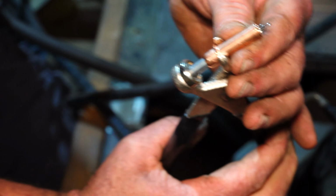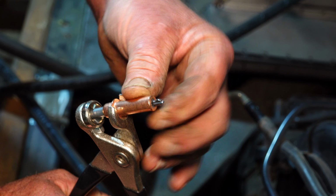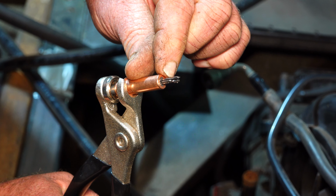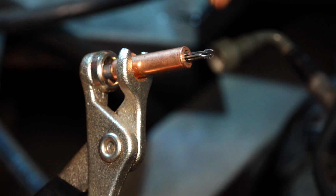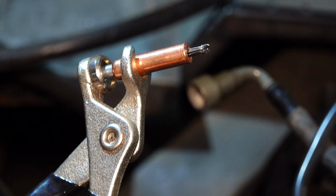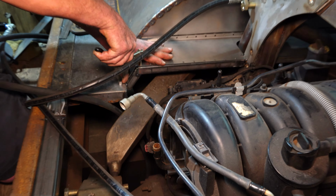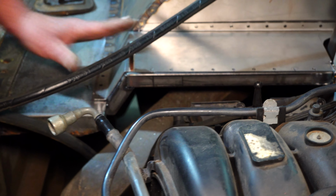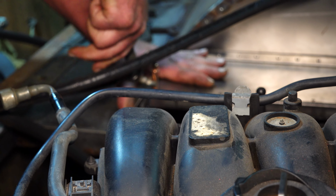But you see how it works. These are the pliers, cleco pliers. You just stick them in, and that little piece there is going to go down, and then it gets skinnier right there, so it'll fit in the 1/8-inch hole. And then when you let go, it pulls it tight, and it wedges it out. So this is for an 1/8-inch hole. Like I said, you can get these for different size holes, but instead of putting a rivet in here to hold it in place, you can just put one of those in, and you can take it out just as fast. So if you need to remove the part, but it holds it nice and tight. Right. Any hoses in the way.